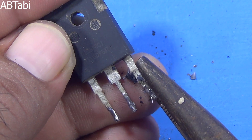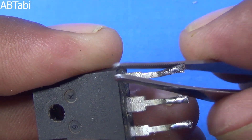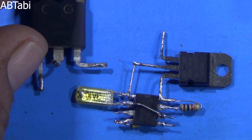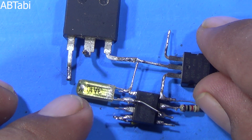This type of MOSFET can be found in a PC power supply unit circuit. You can also try another N-channel power MOSFET. The MOSFET source pin connects with NE555 IC pin 1.